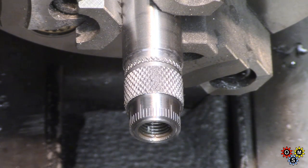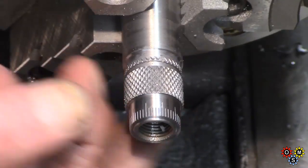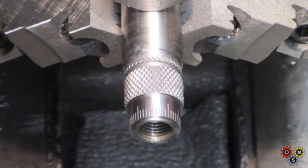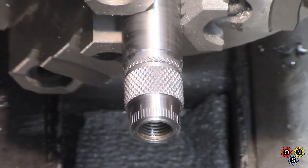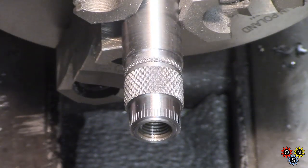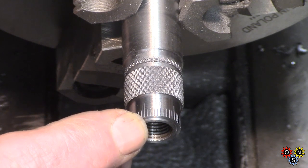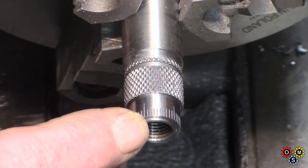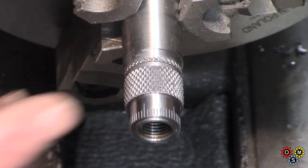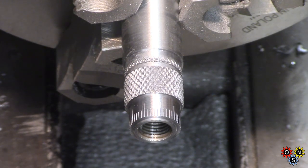My lines are about right for width — they looked a bit wide initially because of course you get a burr down each side, but I'm quite pleased with those. Now I've just got to break this edge very, very slightly — not much — and chamfer on the edge of that knurl. I'll do that off camera, being careful setting it up.